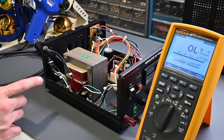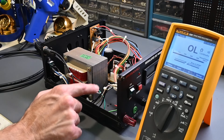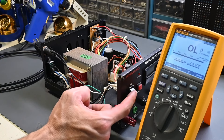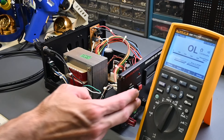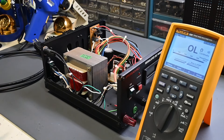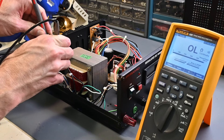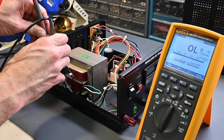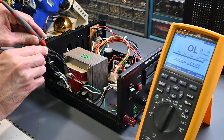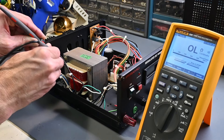The next thing is the switch and fuse holder. The AC hot comes through the fuse holder and also over to the switch — looks like they're switching both hot and neutral. Because there's an indicator light inside that needs a connection from hot back to neutral when it's turned on. Let's check the fuse holder and make sure we have continuity through it. Wow — there's absolutely nothing there. That's an open connection. I'm touching right on those metal tabs where the wires are soldered on — absolutely nothing.